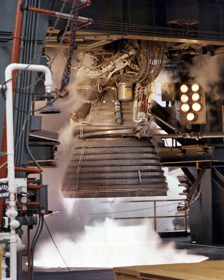Unlike most liquid-fueled rocket engines in service at the time, the J-2 was designed to be restarted once after shutdown when flown on the Saturn V S-IVB third stage. The first burn, lasting about two minutes, placed the Apollo spacecraft into a low-Earth parking orbit. After the crew verified that the spacecraft was operating nominally, the J-2 was reignited for translunar injection, a 6.5-minute burn which accelerated the vehicle to a course for the Moon.